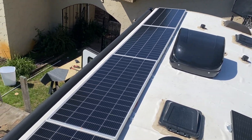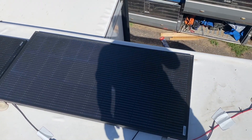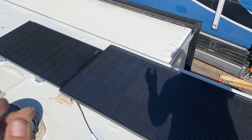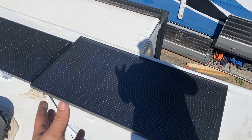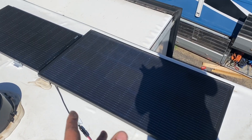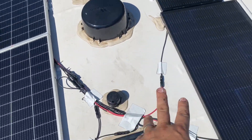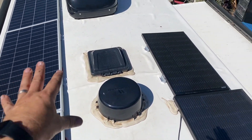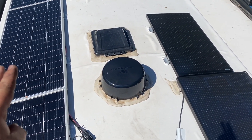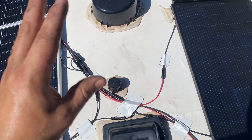We've got 800 watts here. We kept the 165 watt panel and paired that with a little 100 watt Spartan panel. What we get there is basically a 200 watt equivalent to one of the larger panels, because these are 12 volt panels which run at around 22 volts. Add those together and it equals about one of the big ones. These are run in series, then paralleled together — so this array of four panels is a 2s2p configuration.